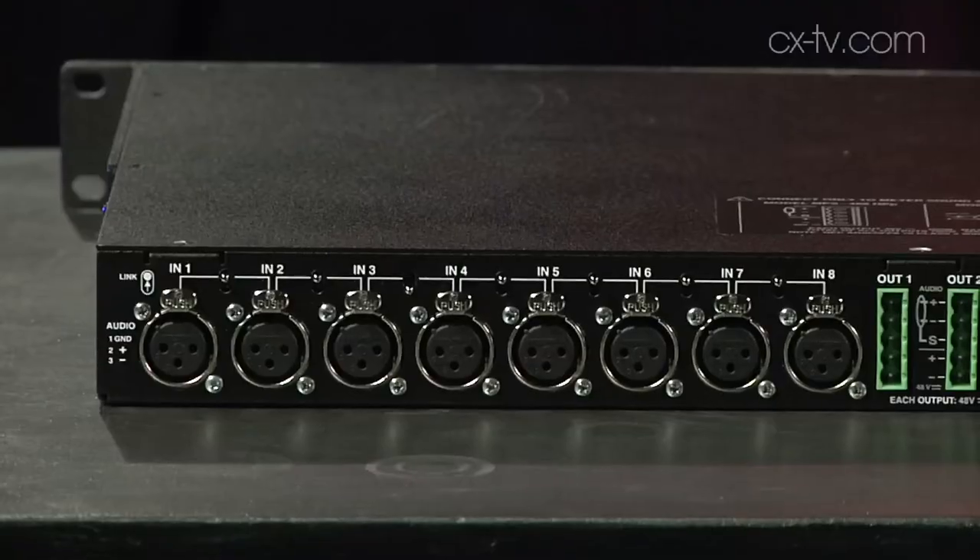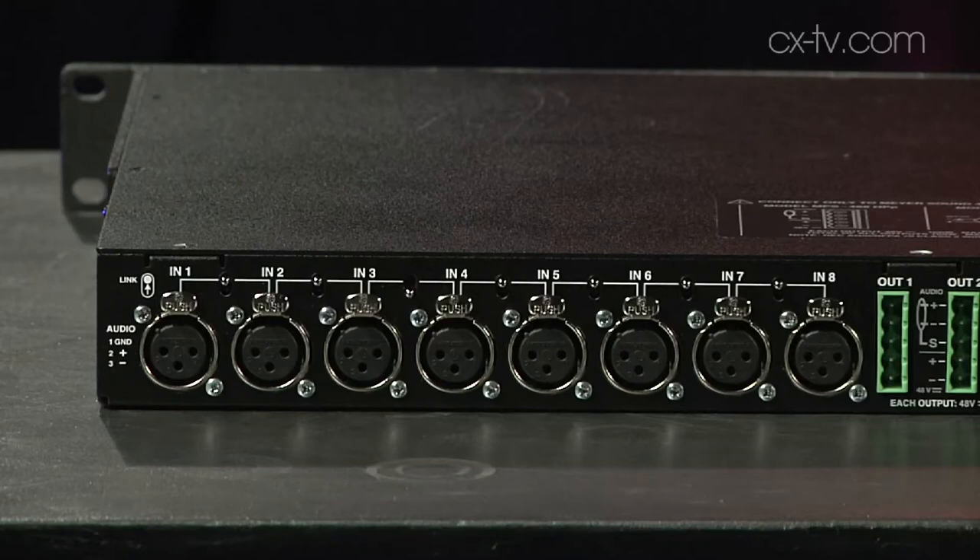So let's talk a little bit about connectivity. On the back of the MPS-488, we've got eight XLR inputs. You can actually join or parallel each XLR input to the previous input. Just for testing purposes, we've run an input into XLR1, which we can then chain to XLR 2, 3, 4, et cetera. Meaning you can send one signal to all eight or you can send eight signals, as long as we line up the front of the boxes correctly. So if you need to do all processing delays, different EQs, you do that before. Also worth noting, you can actually have a Myers RMS system on this box as well, so you can monitor it.